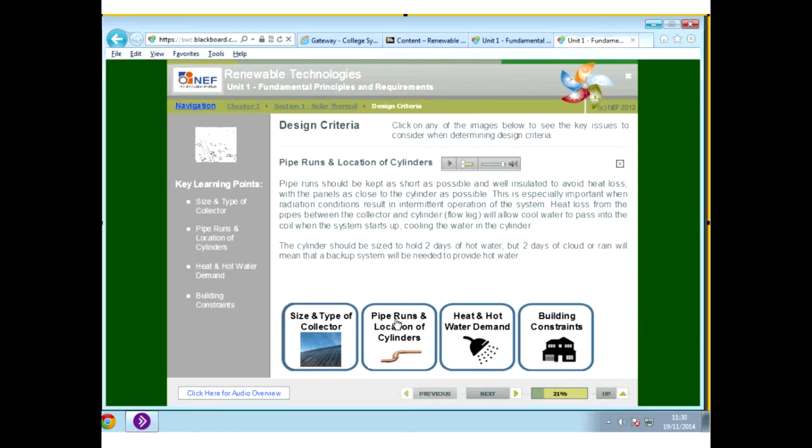So the cylinder stays there, and it looks a little bit like an immersion heater, an electric heater for your boiler. It just sits beside the tank, and it's basically a heat exchanger. Otherwise, it's much better if you go for a larger storage tank or a large buffer tank.